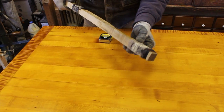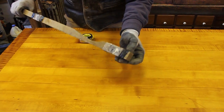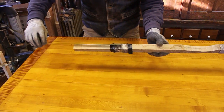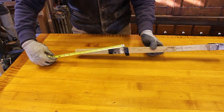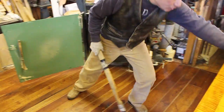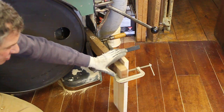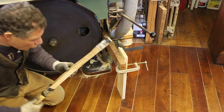What we did is tape some very heavy grit sandpaper onto the stick with electrician's tape. You want to tape one piece here, and tape a swath of heavy grit sandpaper on the other end, with the center of it about eight inches from the end — looking like about two inches wide. Then you want to clamp a couple of tool rests, finding good material in your shop to make a steady rest where the fixture will sit.